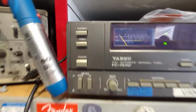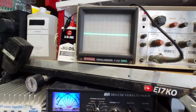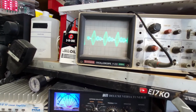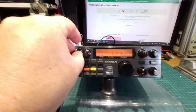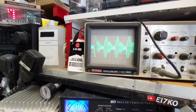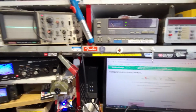So we go to the 150-watt scale, reading across the top. One, two. Hello, audio, audio. 1, 2, 3, 4. Hello, radio. That's upper sideband, lower sideband. Same story, and same story here. By right, I should be injecting a tone in to get that to look right on the scope, but it's just to give you a rough idea of what's going on.